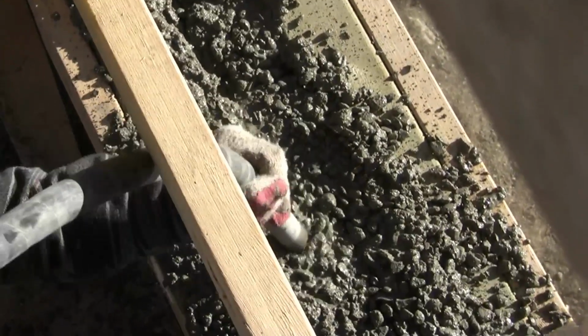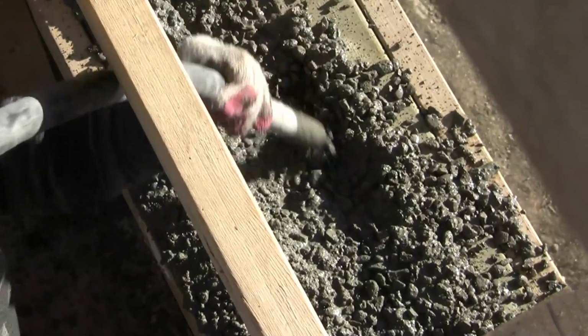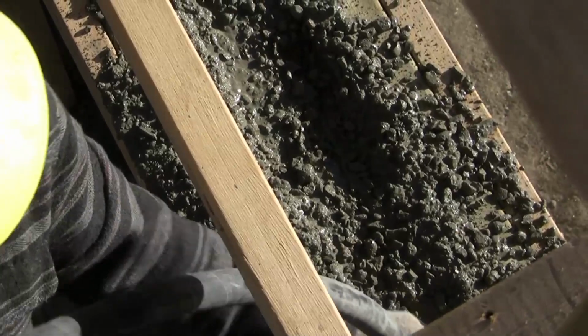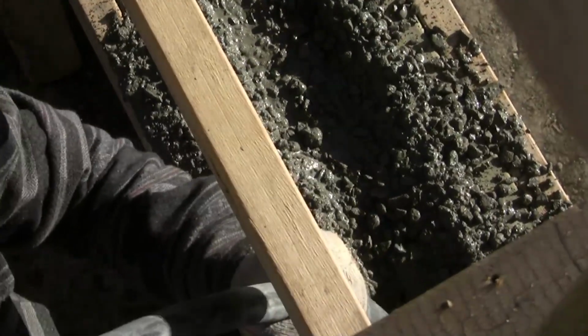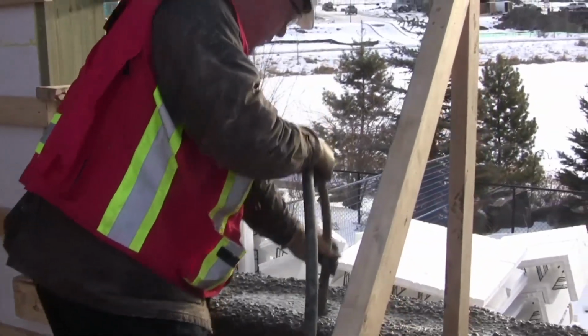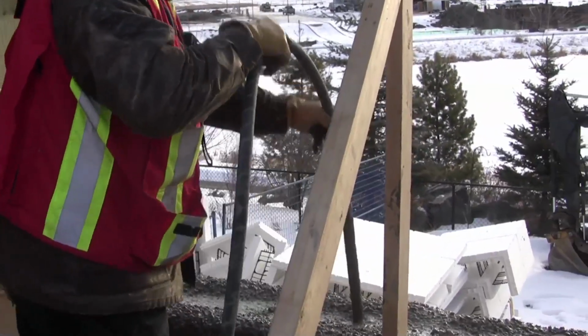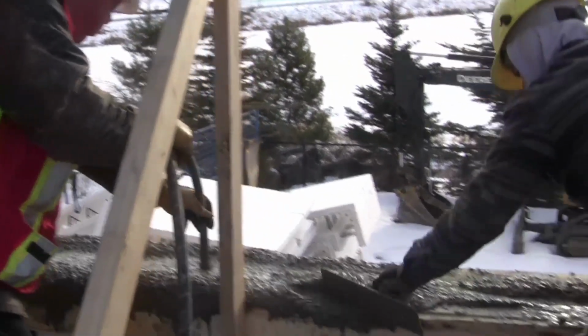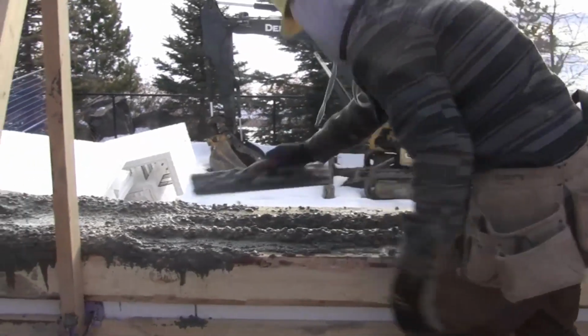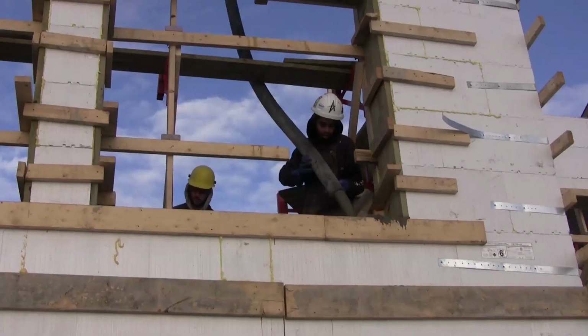It is essential to vibrate the concrete to eliminate air bubbles that may become trapped in the forms. Not vibrating can severely compromise the strength of the walls. When vibrating the concrete, start 1 web space away from a corner, then vibrate every 16 inches or 2 spaces from there on, avoiding as best as possible the vertical joints of the forms. Avoiding the vertical joints of the forms helps prevent bulging or flaring, especially the bottom row at these locations.